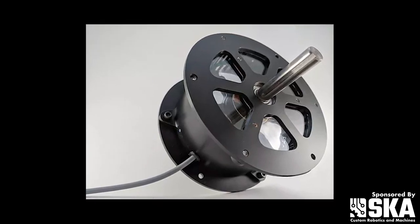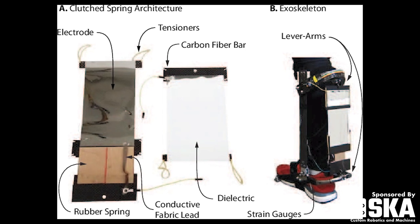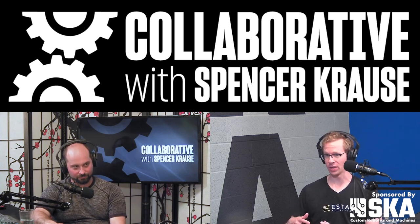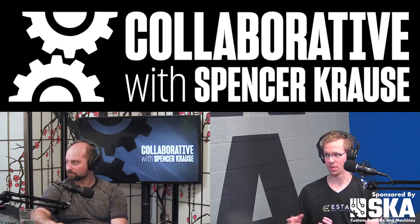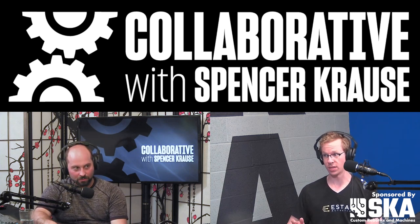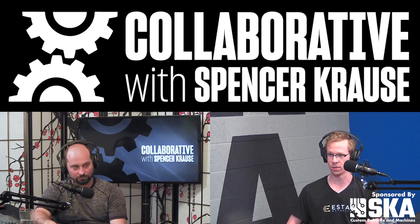What voltages are you pumping through that? We're applying in the 100 to 500 volts range. Conventional electrostatic technology is typically more in the thousands, so being in the hundreds means we can use pretty standard electrical components, which is great for cost and size. The currents are extremely low — peak currents are in the milliamps range and maintenance currents are in the microamps range, so we're using just microwatts of energy.